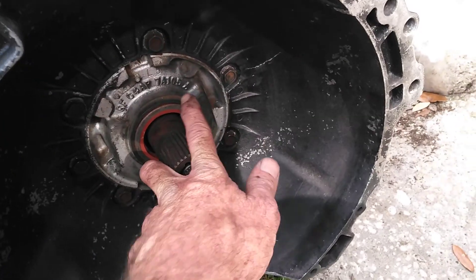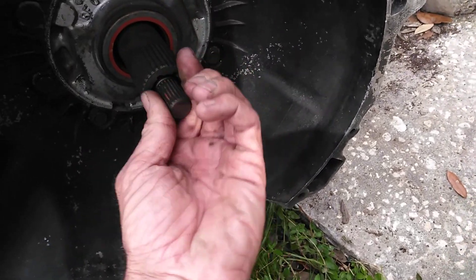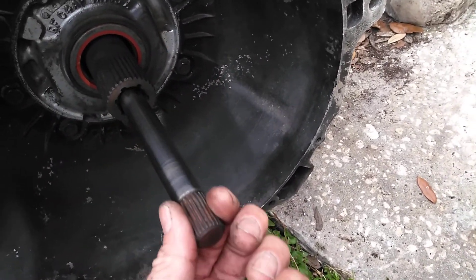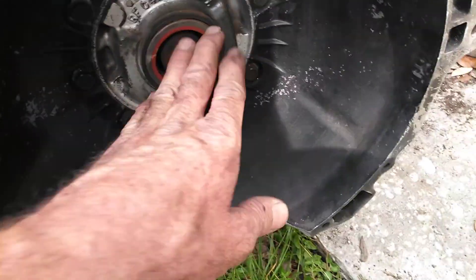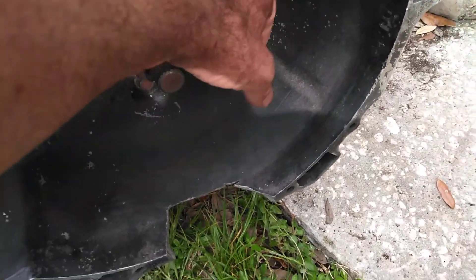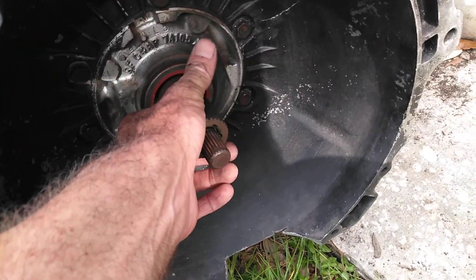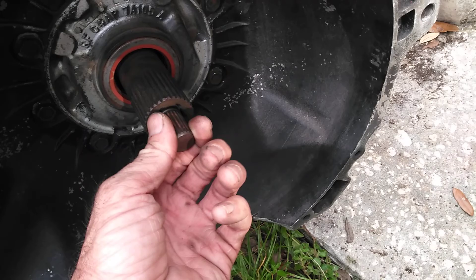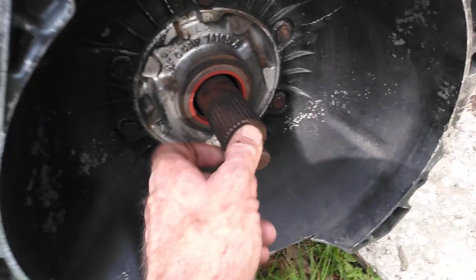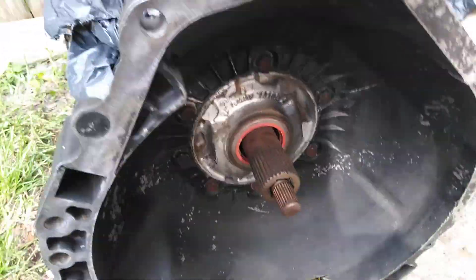Although it bolted up, afterwards I was in a bind. I'm in neutral now and I can spin it both ways and bring it back out. If you get into that situation where you have a rebuilt transmission that just spun in neutral and you just swapped the bell housing out, that means either one of two things has happened: you've got the center part out of alignment and it's in a bind, or there's a washer back there and you pulled it too far out and the washer has come off.